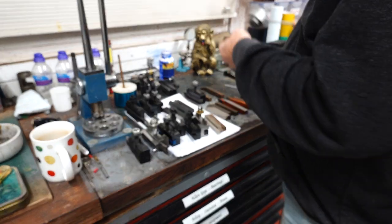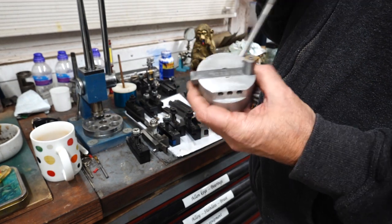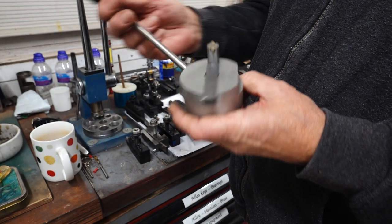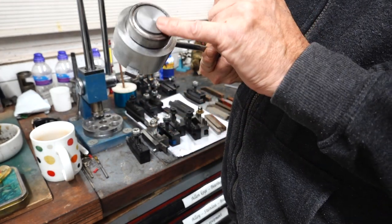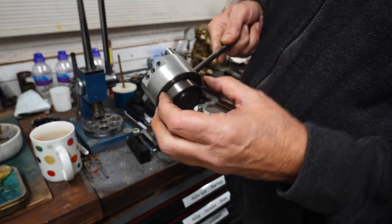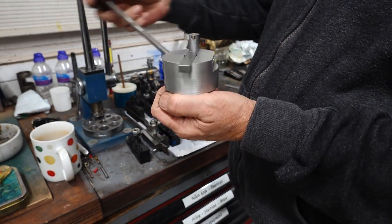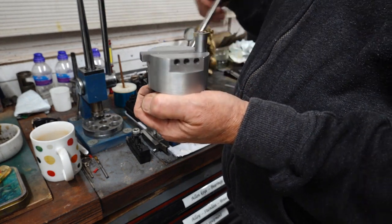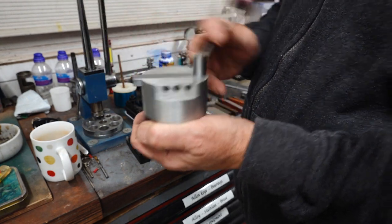There's also my ball turning device that I made for making balls - just an insert tool, a pair of bearings, a piece of bar with a relief on it, and another bearing inside. It locks into my Myford Super 7 compound slide holder. If you've seen my videos you'll have seen me doing that.